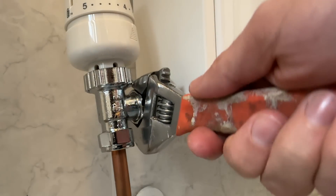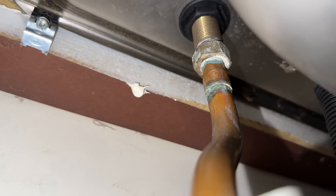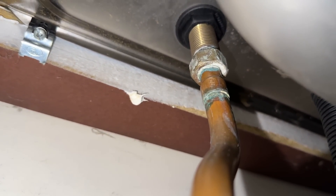There have been a couple of problems. There was a leak from the compression fitting on a radiator in the bathroom, which started a couple of weeks after install — I think it had worked loose from temperature changes. I tightened it up myself. Then there was another leak under my utility sink where they joined the hot and cold water pipes to my existing circuits — it had been dripping very slowly into some plastic drawers. Luckily the drawers caught all the water and they were full of sponges. I called Octopus out and they visited within 24 hours and fixed it — a screw fitting on the tap connector had come slightly loose. I can't really fault the aftercare at all.